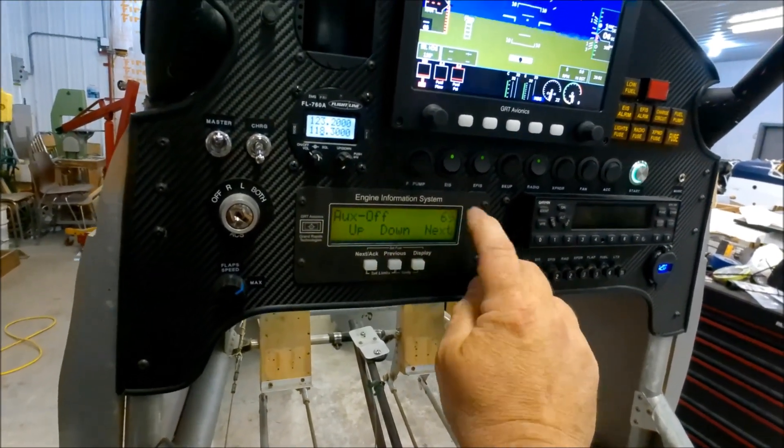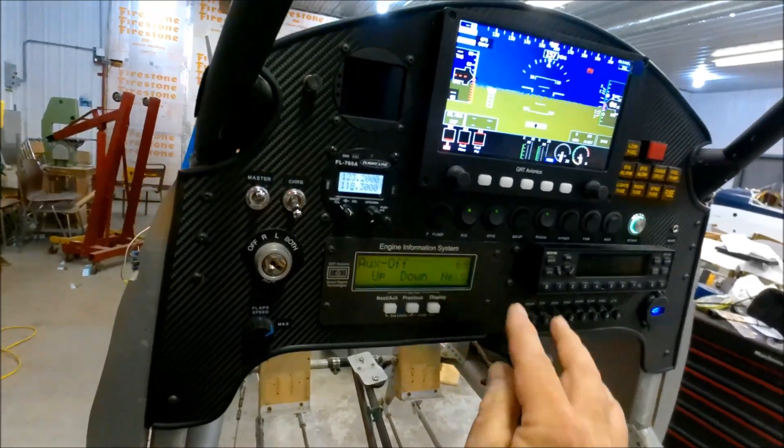That's giving me a very accurate reading of pressure at the top of the scale and all the way down. The offset is 69. Now, that zeros it down — it gives me the zero reading. But when you set the offset, it affects the top end of the scale too. So if your offset is zero and your scale is reading accurate at the top but never gets to zero, you change your offset, you raise it up to say 47 or something. Also, I noticed there's a difference between even and odd numbers. If I go to 68, it jumps a lot — so it's all odd numbers. I don't know why software does that; I'm going to talk to one of the software writers or engineers. As you go higher up on odd numbers, you lower down that zero. On even numbers it actually goes the other way — maybe that's how it's designed. I will find out and I'll post a little update.